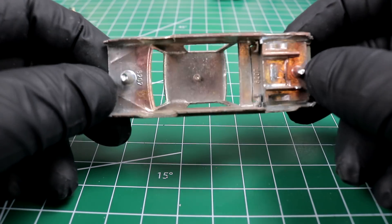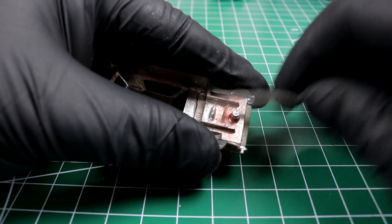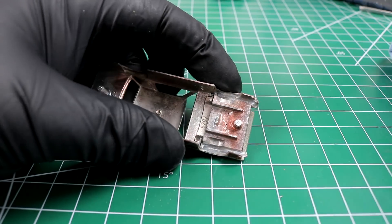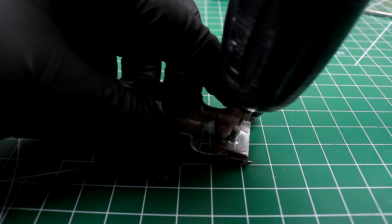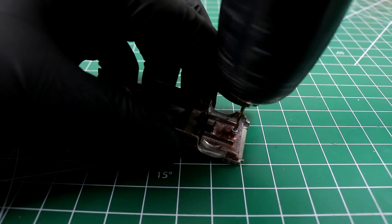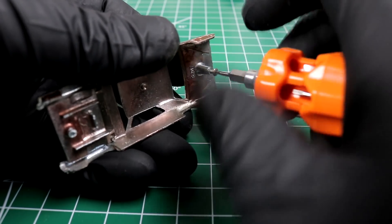There's our body — everything's looking real good here. I'd like to take this opportunity to file these posts flat, and we will drill them out for our screws. That one's not bad. Same thing — do a pilot hole, and then we'll move up to the appropriate size drill bit for the screws. Got the self-tappers here. You just thread these in and they'll make their own threads.